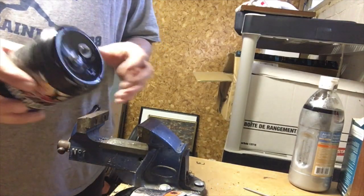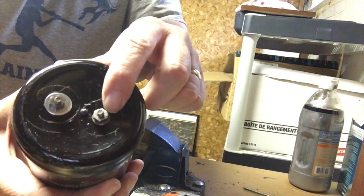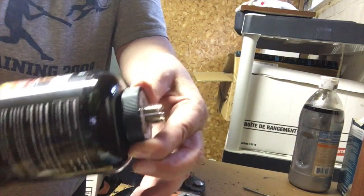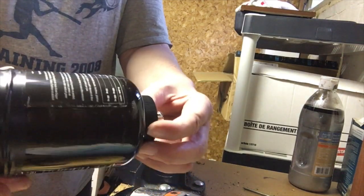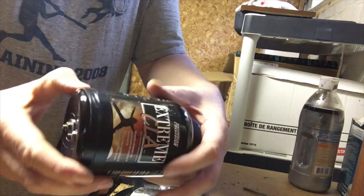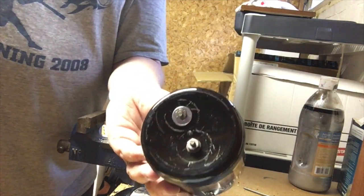I'll put that back on and put some electrical tape around it. There's my antenna, there's my counterpoise — the ground. I've got the lid now snapped into place; it's actually quite snug, really nice. No twisting, no anything. This balun is all ready to go. It's not waterproof of course — I may do that at some point — but for the purposes of camping this is just fine. We'll see how it all works. Next step is to build the fishing pole vertical.